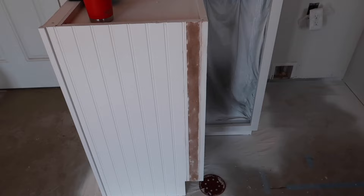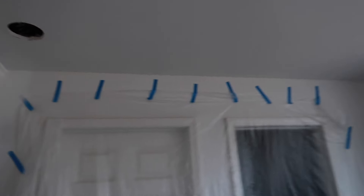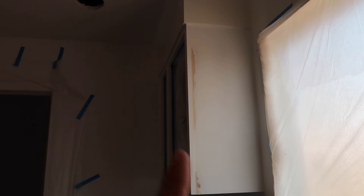There were a few sections of caulk that I didn't fully seal in random places, so I re-caulked. These side panels are actually glued on individually — they don't come pre-glued. When I glued it I didn't notice until after painting that the veneer on the panel had bubbled out, which means it wasn't glued down properly or it's faulty in that section. I ended up cutting it out until there was no loose section, then filled it with wood filler and sanded it down.